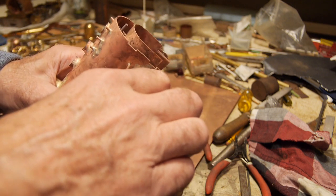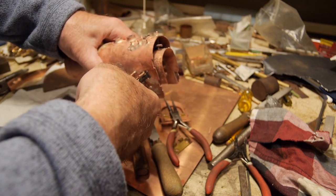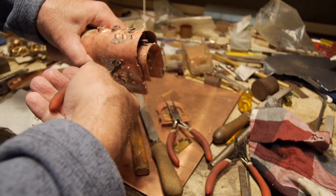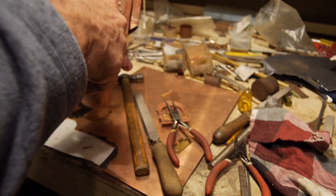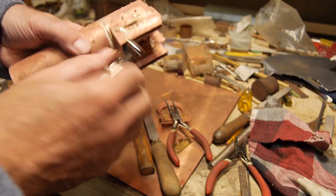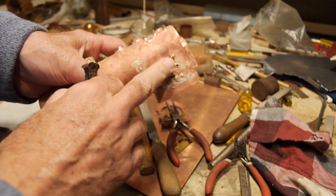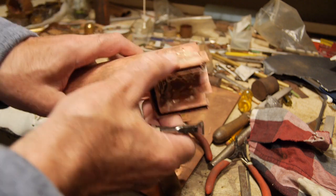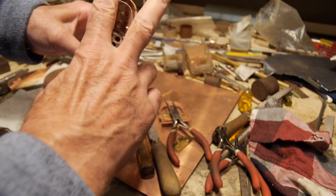The next job is to go around with a pair of clippers and clip off the stay ends — not the whole stay, of course. Clean them all off, do the same on the rest, and then just file the heads. Don't file them completely flat — you want to leave a little bead around the stays and not take the bead completely off.